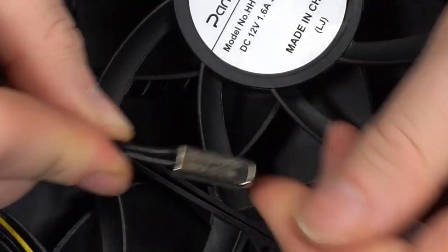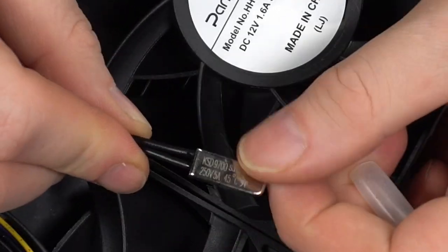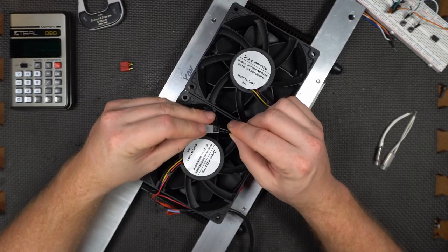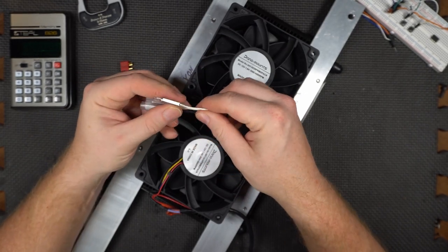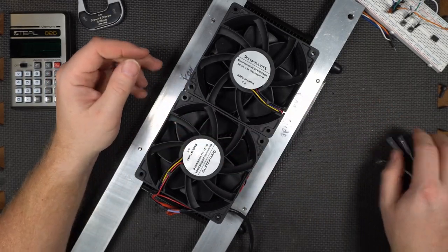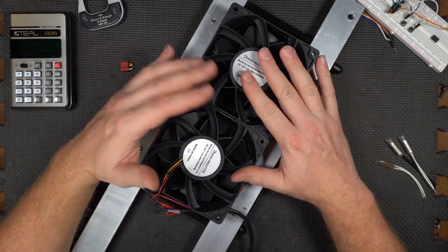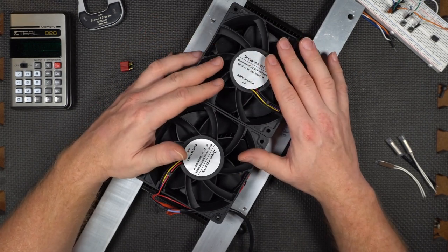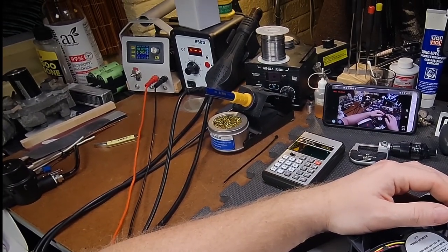This one happens to be 45 degrees Celsius, and it is normally open. So when it hits 45 degrees Celsius, which is about 113 degrees Fahrenheit, it closes. They make them normally closed, normally open, all kinds of different temperatures. I'll put links in the description below if you want to get yourself some. These are generally rated at 5 amps. Well, these are server fans, 120 millimeter fans, that are rated at 1.6 amps. But remember, they're going to be overvolted a little bit, and I'm okay with that. So they move a little bit more than 1.6 amps, but we'll see that on the power supply over there. So let me show you how this thing works.